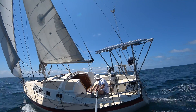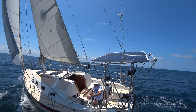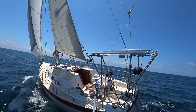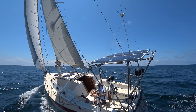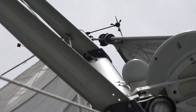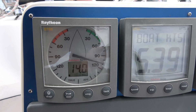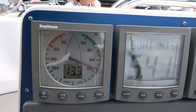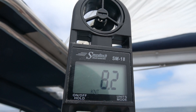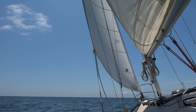An important sailing principle is to realize that the wind speed varies tremendously with altitude. It is amazing how much of a difference you can get from measuring the wind on the deck to measuring wind at the top of the mast. I have a friend who has a wind gauge on the top of his mast — the reading from the top is approximately 13 to 14 knots while the handheld unit at deck level is only reading eight to nine knots, so we have four or five knots more wind at the top of the mast than the bottom.